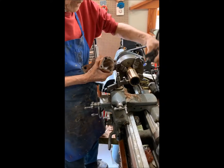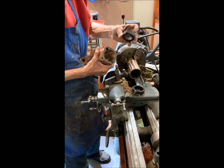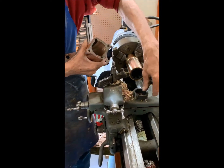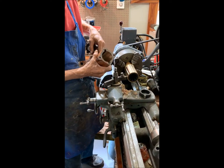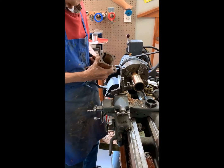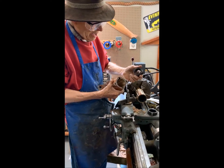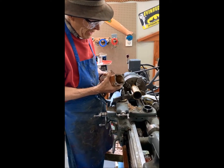What we've got here is a bearing housing, and these were for a cutlass bearing. This is a very old style — seven or eight of these were pushed in to form a cutlass bearing, which is a water-lubricated bearing for a prop shaft on a boat. The problem is they don't make these things anymore. This is from East Hope and they don't have any old stock anymore.